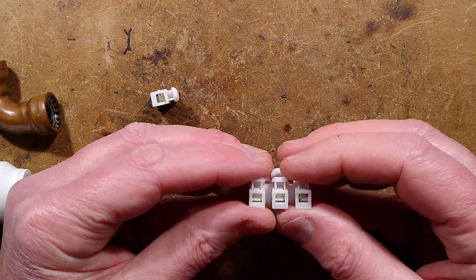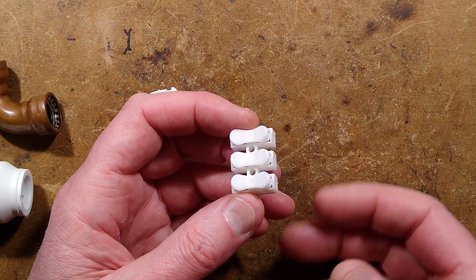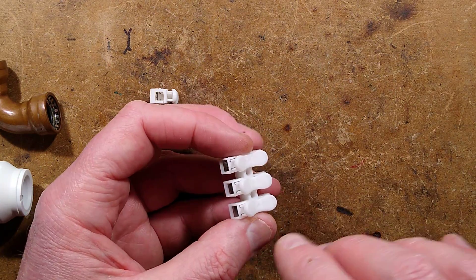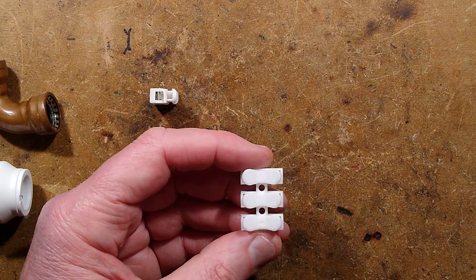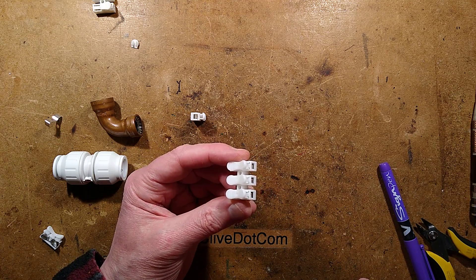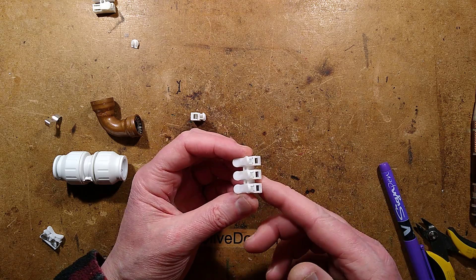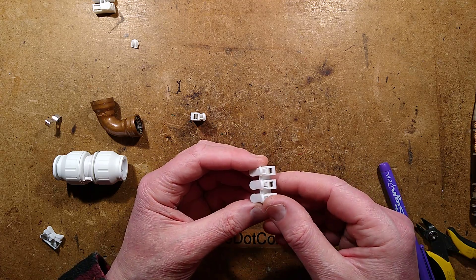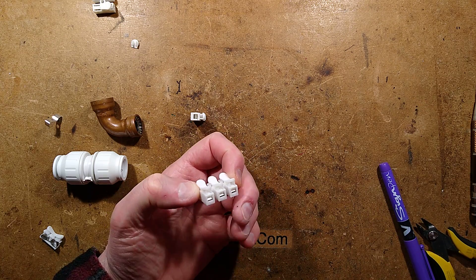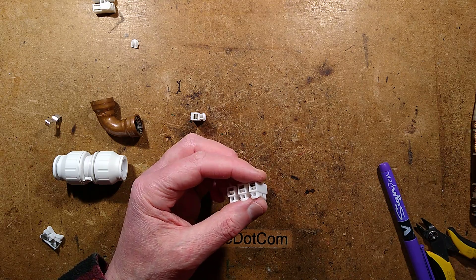These connectors might be okay inside an enclosure at very low current, but I really wouldn't recommend them for anything like a power circuit. They're really just aimed at fluorescent or LED fixtures, where there's no risk of them being touched even in a junction box. It's interesting to see what options are available and ponder where people might be using these, not realizing there's no copper at all — it's just steel on copper wire, so it's going to have a slightly higher resistance. And since it's not copper-to-copper contact, you might have issues there. Interesting to see what you think about potential corrosion or interaction between the copper and the stainless or spring steel tang.